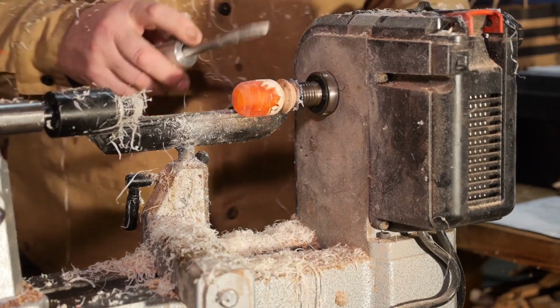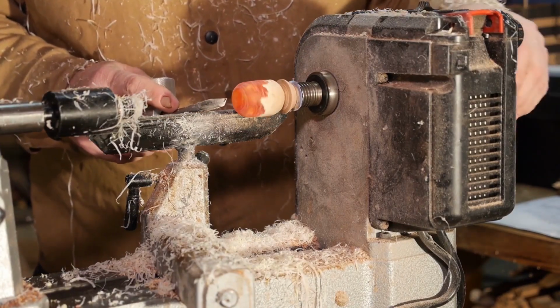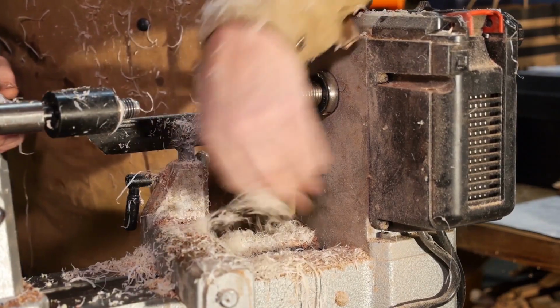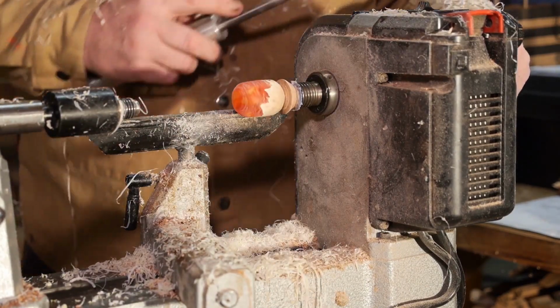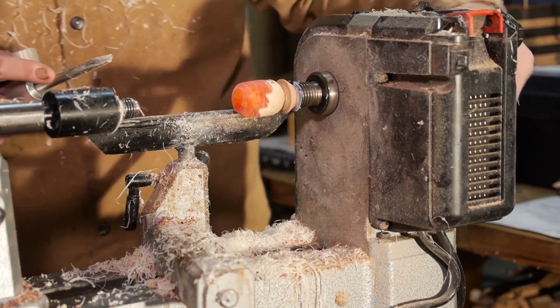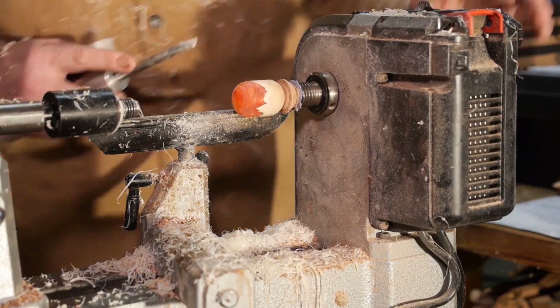With a hybrid blank like this, the Alumilite, although you can cut it, really prefers to be scraped. The wood, although it's been embedded with plastic and cactus juice, prefers to be cut. So you wind up going back and forth between reduction methods, and you try not to forget which is which.